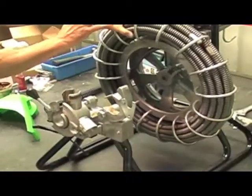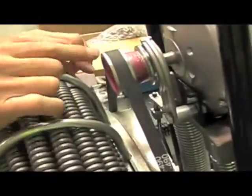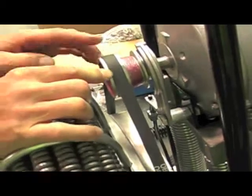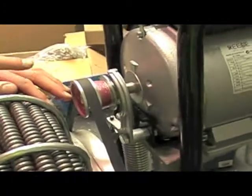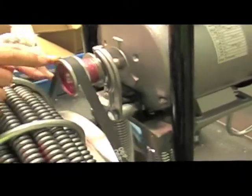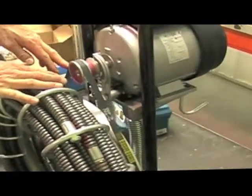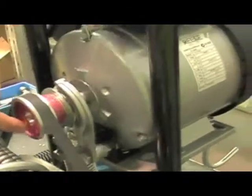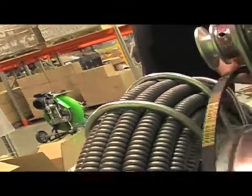If you need to replace the belt or the pulley — as machines get a little bit older, this pulley for the fan belt actually wears, and you mightn't think it, but it gets grooves in here. When it wears, it reduces inside and changes the speed. The drum will never change in speed, but this pulley will wear, and when the belt wears, the machine will actually go a little bit slower. To remove it, all you do is press down the machine, because the machine is spring-loaded. Be careful when you take that off for your fingers getting caught under it. And that's the belt off there.